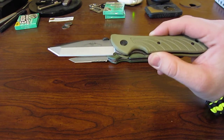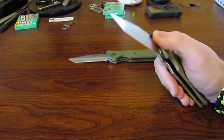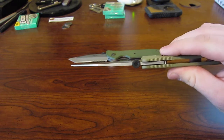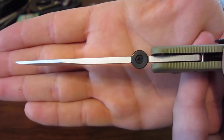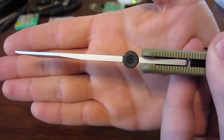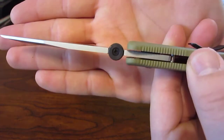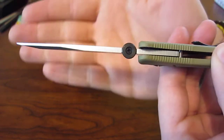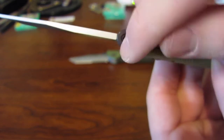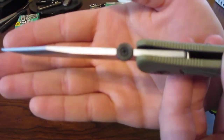This model here is a 2001 model. The original Emerson Ravens produced in 1997 did not have this circular thumb stud you see here — in 1997, the thumb studs were oval. What happened was when the shipment of thumb studs came in, they were too large for the slot that had already been milled into the knives. So they cut the thumb discs so that the top and bottom were oval — this side was radiused, and the other sides were flat. Thus the term: the oval thumb disc on the '97 Ravens.